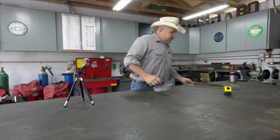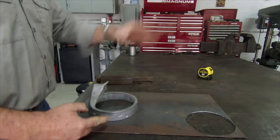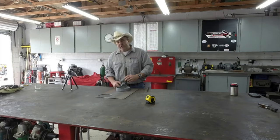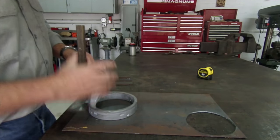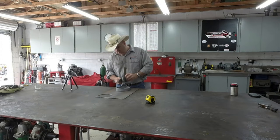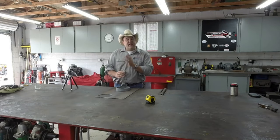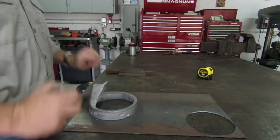So I was thinking about it. Here's what I think I'm going to do. I just got a dropped off piece of 11 gauge steel and a couple other drops that came off my bandsaw over there. And I'm going to weld this to here, and I'm going to do it in an inconspicuous area so I can cut it back off and reuse this drop again. I'm not cheap, I'm thrifty. We can take this piece and it'll sit right about there. Another little drop of angle iron. We can bore a hole for this center hole right here, bore a hole in this piece of angle and bolt it up. Once we make this fixture, then we'll grind it, because we can use this as it sits right now to get everything lined up true like it was before it got broken. Once we grind it, then we can bolt everything back in place and we know exactly where everything has to fit.